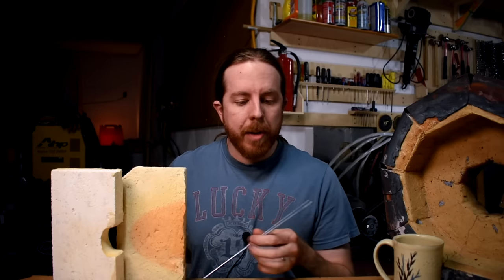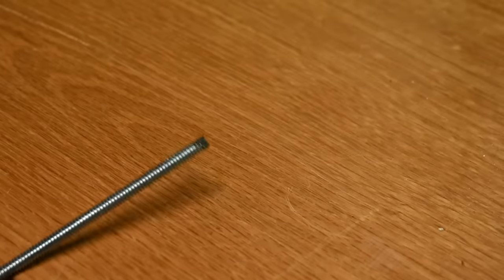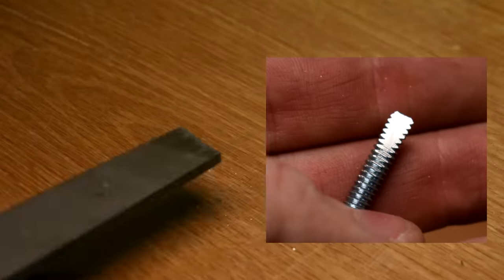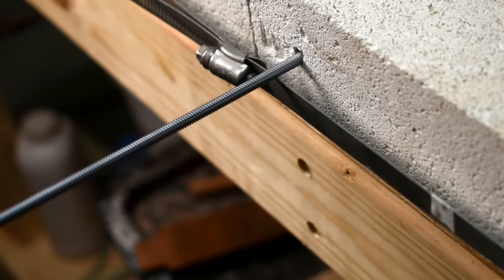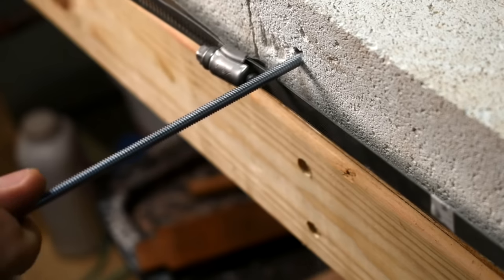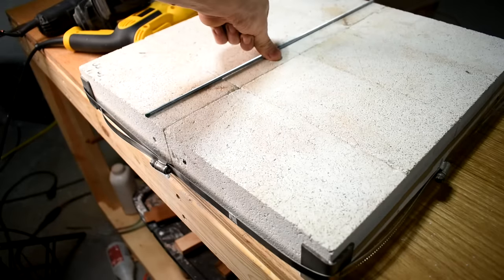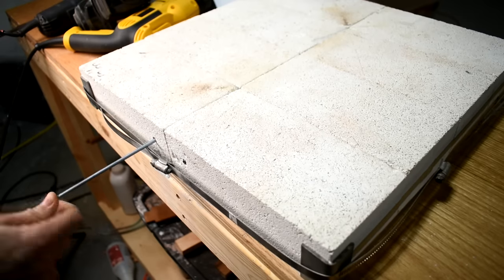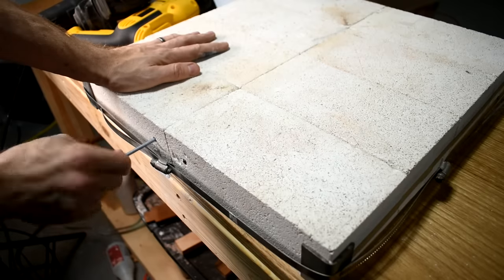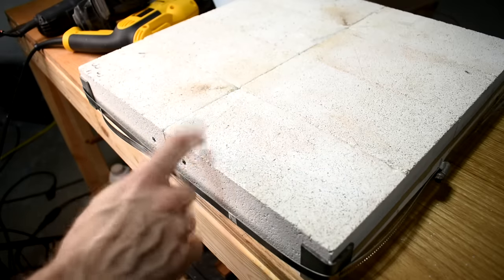To get these rods through the bricks I'm going to bore a hole using the rod itself. But it needs a drill-bit end, so here's how you do that: using a grinder or a file, give it a chisel end, then adjust it until it has a slight point in the middle — kind of like a drill bit end, just a lot worse, but the brick is pretty soft so it should work out. I'm gonna run it through the sides. I'd use a big drill press if I had one, but I'm going to hope I can get it through straight with a normal handheld drill, then cut the end off with an angle grinder. The threaded rod was exactly twice the width of the lid, so I don't even need to get another one. The hole is a little tight, but I'll just thread that right in. That was surprisingly easy to do.